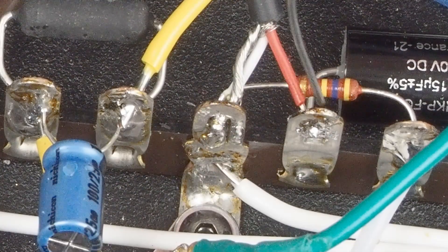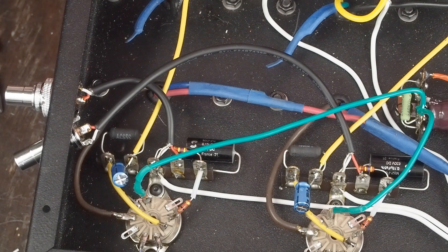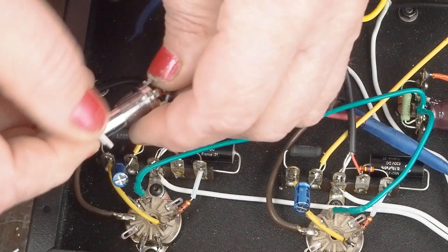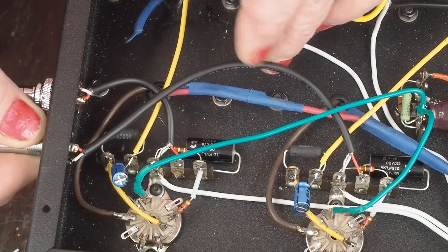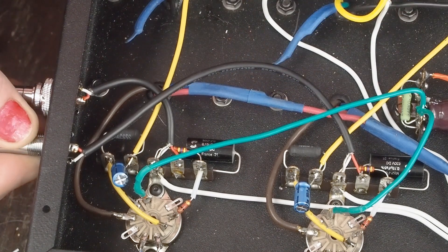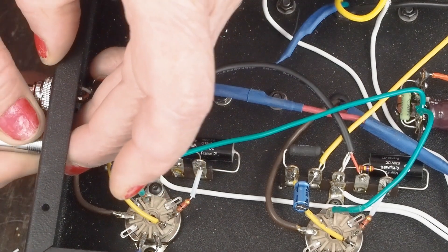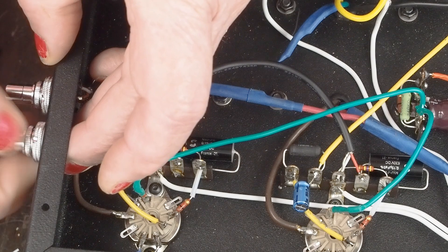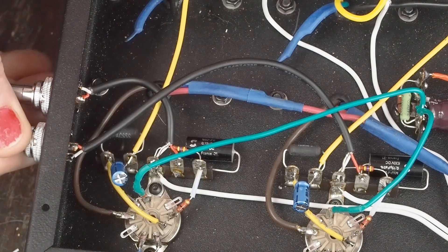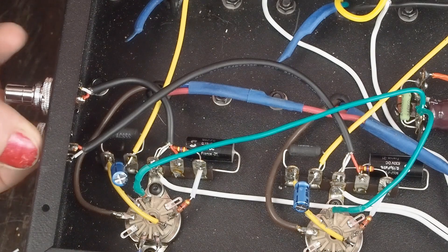This terminal here goes down to the coupling capacitor going to the grid. At this point we just put our insulating washers on the RCA jack, rotate it where the wire looks like it's in a nice place, and bolt this guy down. Hold that with one finger, make sure that little shouldered washer is centered in the hole — I put it on the inside — then snug it down and come back with some pliers across these little notches in the nut and tighten it up.